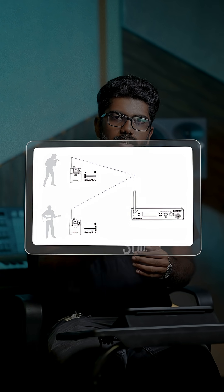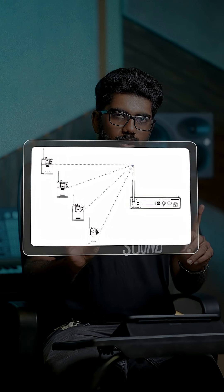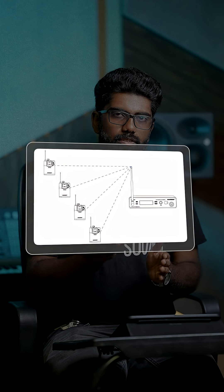The next thing is line of sight operation. Basically, what it means is the receiver should be able to see the transmitter, and there is no barrier. You should not keep it inside a box. The antenna should be outside, pointing outward — line of sight operation.